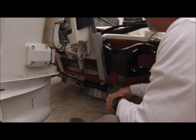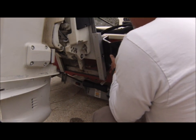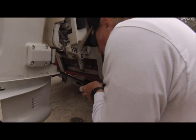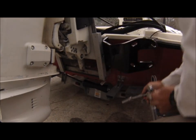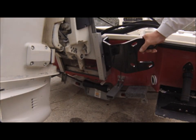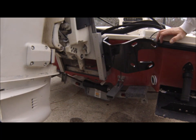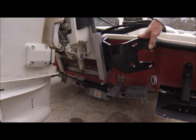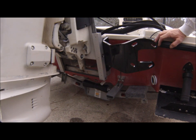Before I get it too tight, I'll move the jack plate up a little bit. I like mine all the way up so we have no drag on plane while cruising or when we're trying to get out of the hole. Now I have successfully mounted the power pole bracket to the jack plate and now you can mount your power pole. Pretty simple, very easy. Power Pole made it easy — they've got everything you need: the spacer, the brackets, every kind of bracket you can imagine. It was a little more difficult today because there were no pre-drilled holes in the jack plate, but it's no problem. You just mark your holes, drill them out with a half-inch bit, and you're good to go.